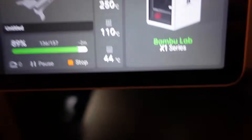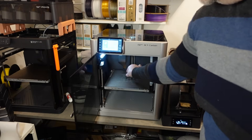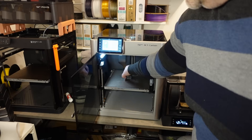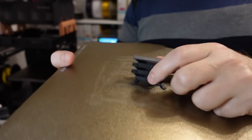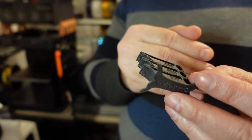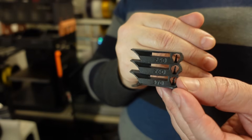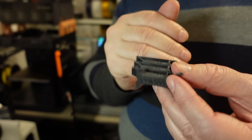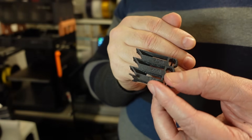It's printing the last element at 250 degrees Celsius, but it is hard to see the details. The printing finished a few seconds ago — immediately I want to check the bed adhesion, which is great. I will wait until it cools down and then remove it. Thanks to the glue it sticks well. It looks great — absolutely no stringing, fantastic overhang. Only the bridging is not 100% perfect, but very close. Great first layer. I can print on any temperature element, and for better layer adhesion I will print at 270 degrees Celsius.